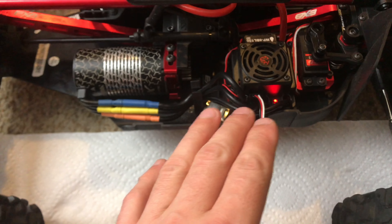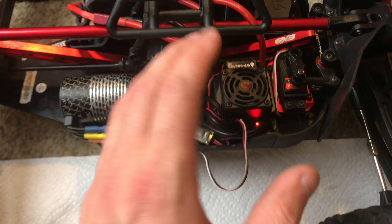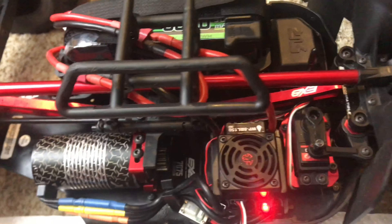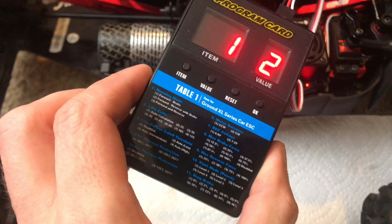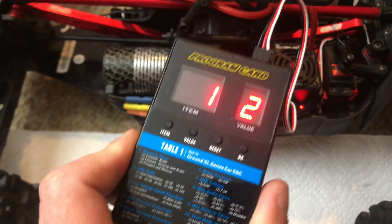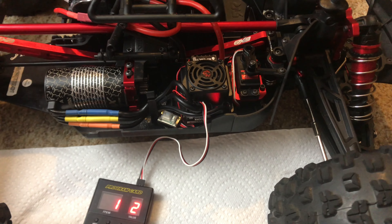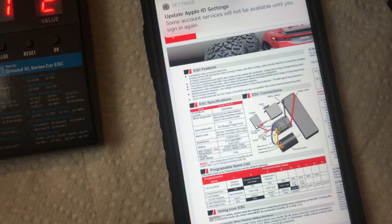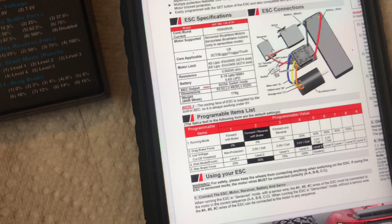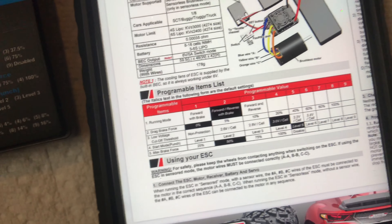These settings should be in line with this table, but these Red Cat ones — or at least this particular rebranded Red Cat one — don't have as many programmable features as the Hobbywing branded ESCs. I found that out the hard way because I was trying to program using these settings, but they're not like this at all. I have on my phone what the settings are for this particular ESC. It shows that for a Hobbywing ESC there are 11 programmable settings, but for this Red Cat one I looked up online, there are only five different programmable features.